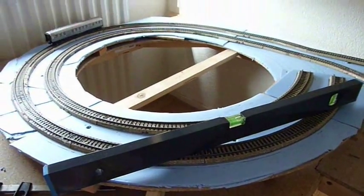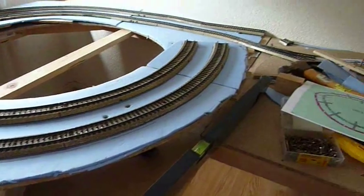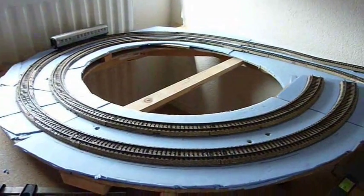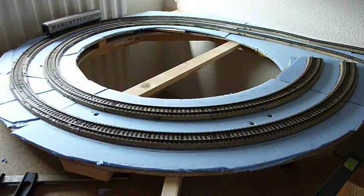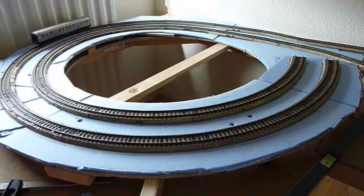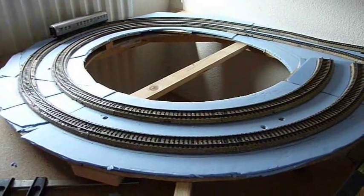I'm using a 100mm differential for each circle, which makes all the other measurements quite easy - halfway around is 50mm, three-quarters is 75mm, and one-quarter is 25mm, so you can build up the helix that way.